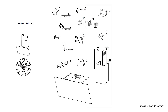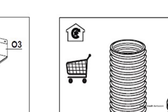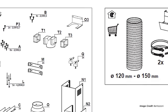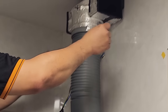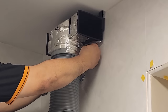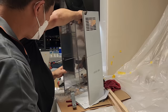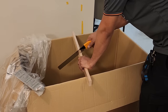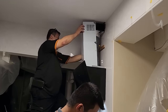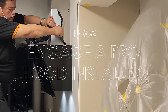If time permits, buy the duct cheaply online or at DIY stores for around $25. Mr. Ong used aluminium tape to give a vapour seal so the connections are airtight. The metal chimney is very thin and flimsy, so it helped to support it with wood in the middle section. After seeing this, you'll understand why we highly recommend a professional hood installer — try not to let your ID have the carpenter or an unqualified person install your hood.